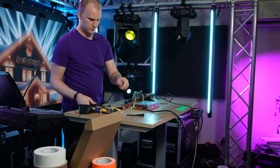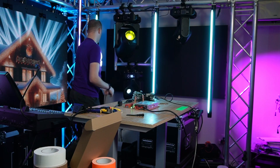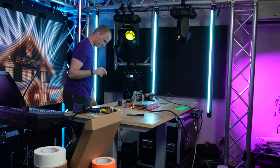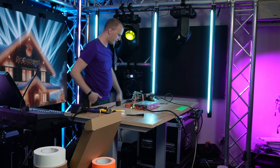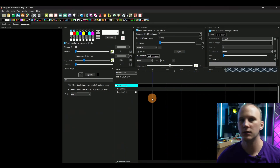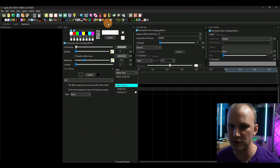Plugging it in at the Pixel 2 DMX end. I'm going to set the DMX address of my light — actually, I'll hook up DMX first. Get this out of the way of the head so it doesn't cause any problems. Set my address — we said 301. Doesn't seem to be getting any DMX yet, which is fine because we're not transmitting. So now let's go ahead and turn on output to lights. This is my first time doing this. Nothing happens — that's okay.